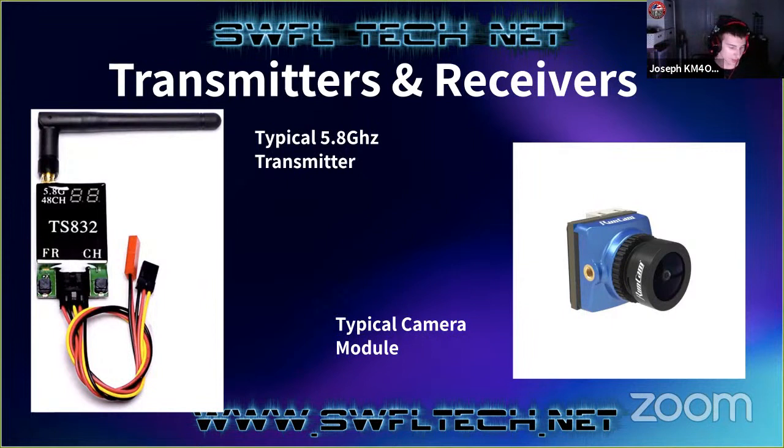And the price of these things is extremely low too. These little cheap transmitters cost about $10 on Amazon. You can get a pack of like 20 of these for almost nothing at all. And it's good too, because sometimes you break them, sometimes you overheat them. They do get quite hot when they're on. If they're not cooled properly, they can fry themselves. The connectors on them are not always the best, and they're easy to break off. So it's good that they're cheap, but it is interesting how this video transmission technology has gone from being a pretty rare thing, used by television studios to get wireless coverage for their in-the-field cameras.